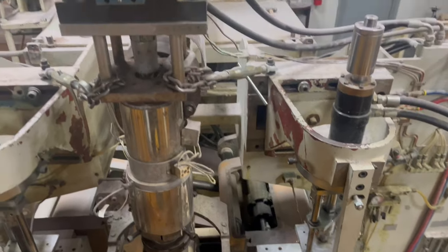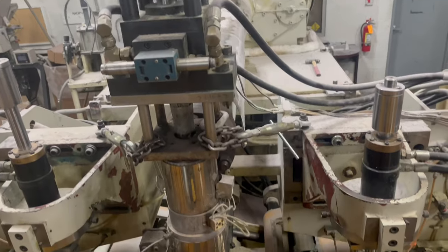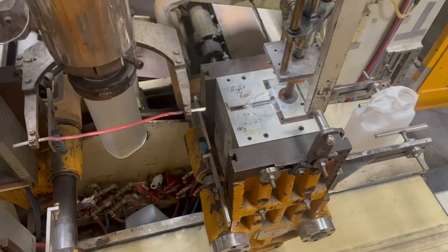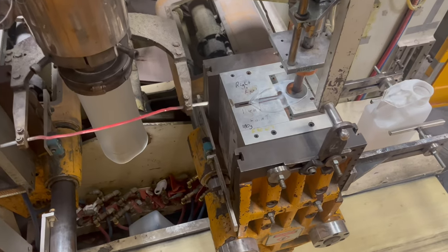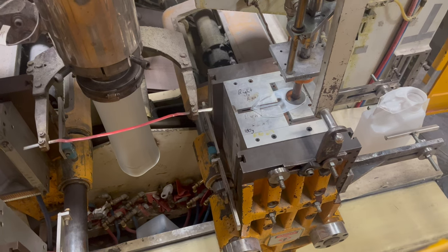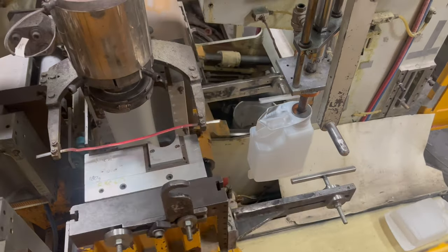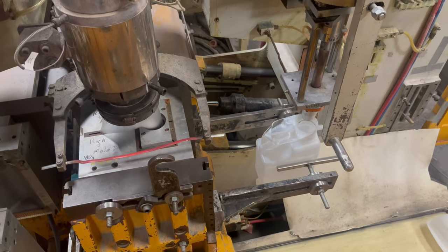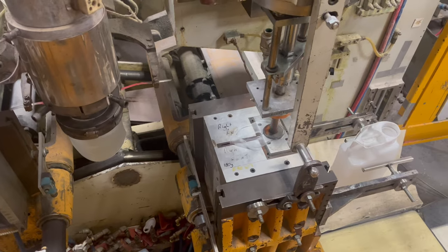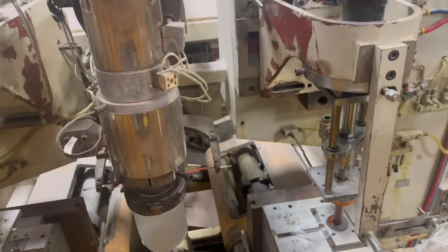This is just a little bit of an aerial view so you guys can see the head of the machine, the mixer, the extruder, everything that goes on on top. Whenever that blow pin comes down into the top of the mold, that's what fills the jug with air and creates the neck — the part that the cap gets screwed onto. The threads and everything are formed right inside of the mold. There is no post-processing required for this. The bottle you're seeing being made here is a universal one gallon jug.